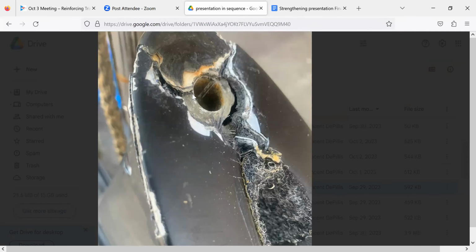Again, I think this goes back to the strength of the rudder and the strength of the cassette. What we found in Jeff's rudder when we started grinding away was that there'd been water intrusion, a layer of stuff in there that was just soaked, and we decided there was just no way to really fix it. It was carbon over foam, but it didn't appear to even have a spar in the middle, so it was just a carbon tube essentially. My guess is that a little moisture in there and the working back and forth was just starting to crush the foam. So there wasn't really anything in there at that location that was helping keep the foils apart.